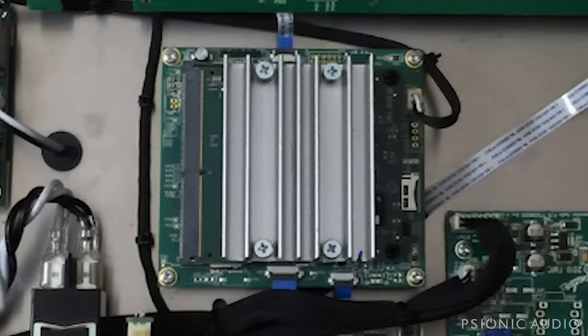The big thing in the middle is the quad-core CPU - essentially a fairly powerful laptop CPU with memory smack dab in the middle of your amp. This entire amp is an amazing feat of computer engineering; if they've only got it 95% as good as a real one, that's a stunning achievement and they're doing it with a lot of processing power. That said, it is literally processing power - it is a computer component. The people qualified to do component-level repair on CPUs, none of us can afford to hire per hour because they're all under contract doing designs. This is designed to be replaced - if it fails, the entire thing gets replaced. And again, how long will that be available and what will it cost once it's out of warranty? These are the known unknowns.